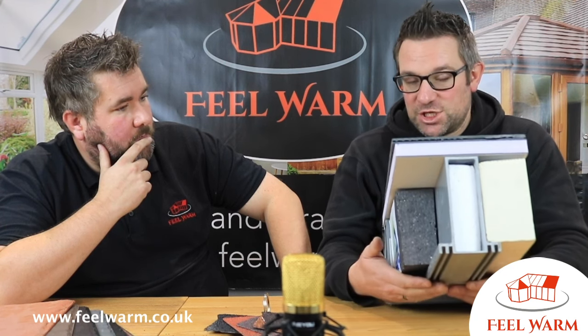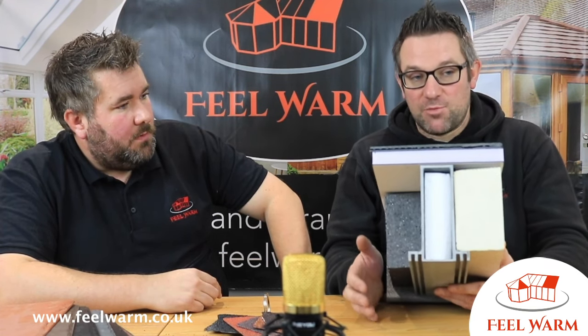And when the regulations go up again in 2025, there's already about a 3x2, possibly a 4x2 packing they have to put on the frame. That's going to mean a lot more, because these other systems, without changing their rafters and the way they extrude them, which will cost them too much money, the only way they can go is to beef up the internal plasterboard. So that means they've got to put an even bigger timber packer on the frame to get around it.